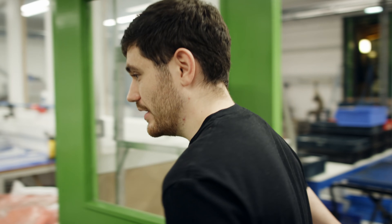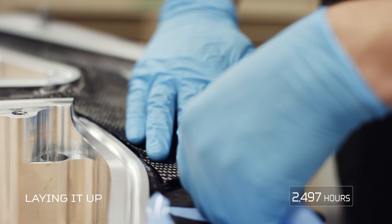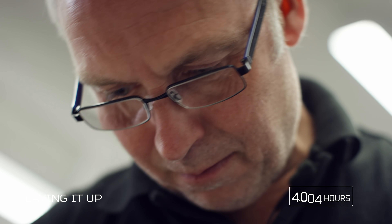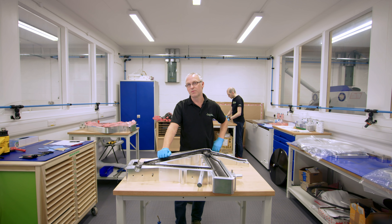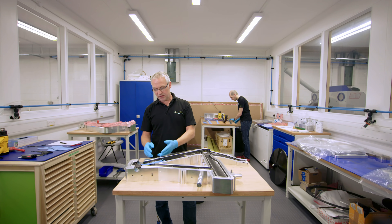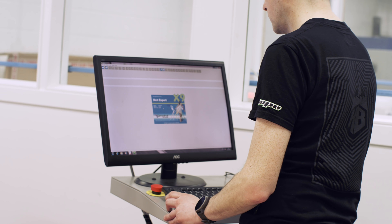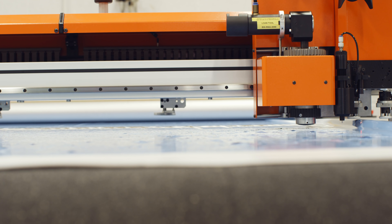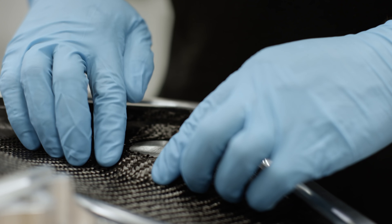This is actually where the frames are manufactured and laid up. This is the mould size we're working on at the minute — one of the small variants. My name's Chris Clark, I'm a composite engineer at Hope Technology. We've done various projects from Defence, Formula One — you name it, you can make it in carbon fibre, glass or Kevlar. Years ago you'd get a piece and cut it, trim it, put it in. Now we've got software where you can develop the shapes and open them out into 2D to go onto the cutter. Once you've got all your pieces they have to be laid in, in the right place with the instruction. It's like 20-odd hours to lay one of these up — there's 320 pieces or something like that in it.